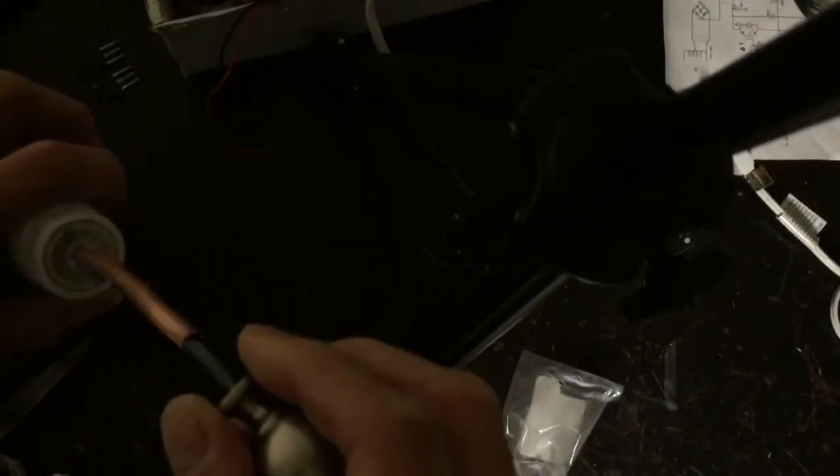What I'm doing is poking a hole in the cap and adding a rounded electrode. I'm using some copper tubing, and that setup works well — it prevents corona loss.